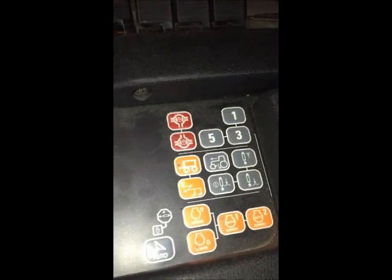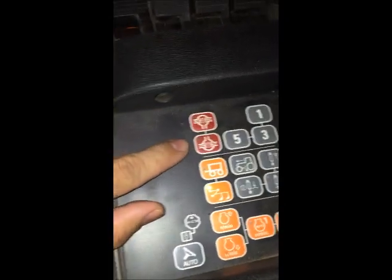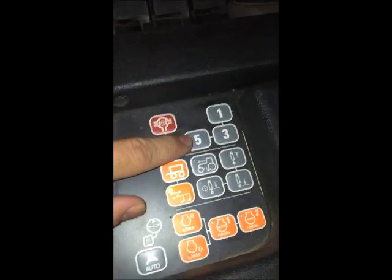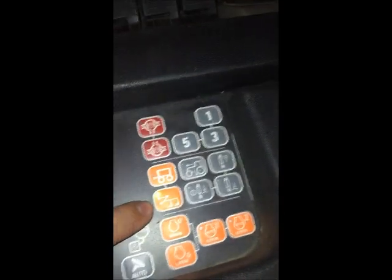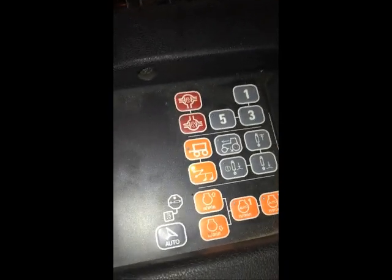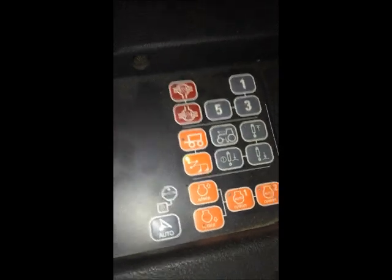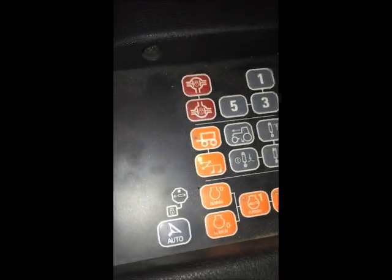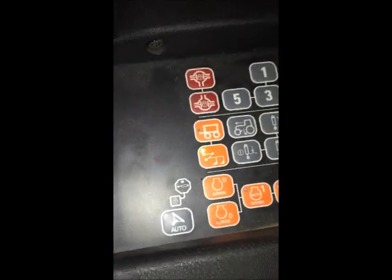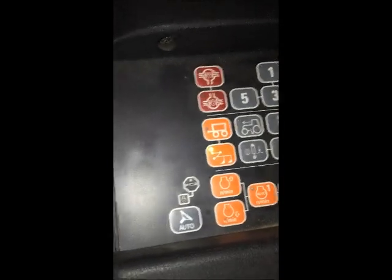Next we move on to a lot of other buttons this tractor is capable of. These two are your differential locks. These are your different types of settings for your field selections. And then this button right here is the plow button — as you can see it's green. When that button is green and engaged, the tractor will work its best to stay at a target speed at the most efficient rate, shifting up and down accordingly so it's pulling the implement at the most efficient work rate.